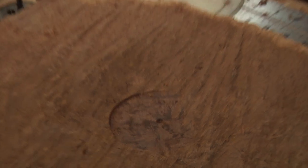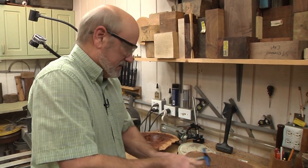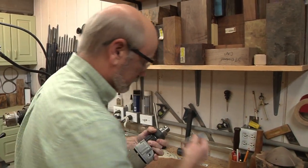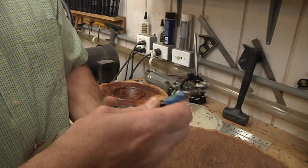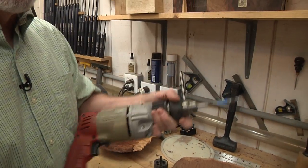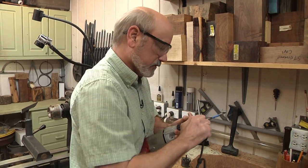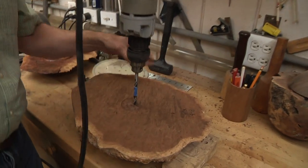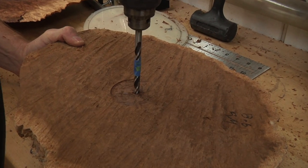Now I need to change out bits because I need to drill a hole for the worm screw. This stuff is so hard that you're going to have to fish around to figure out what size bit to use for your worm screw. Green wood will let you do a smaller hole and the screw will dig in better, but when it's dried wood you've got to be just barely smaller than the worm screw to make it grip right or it won't screw on.